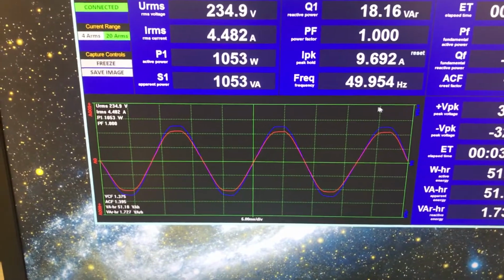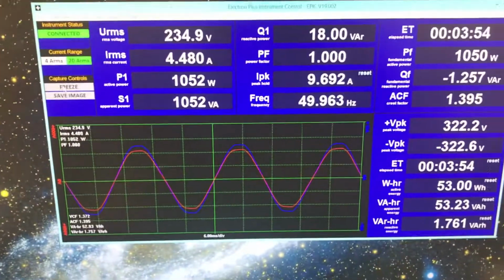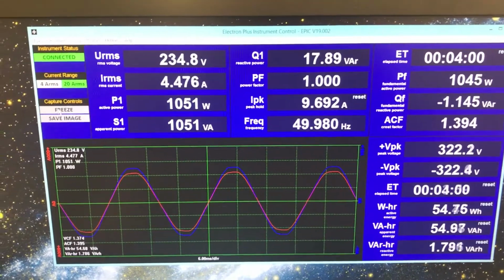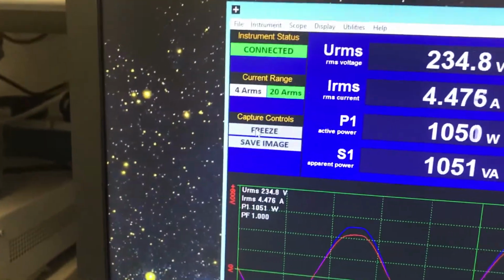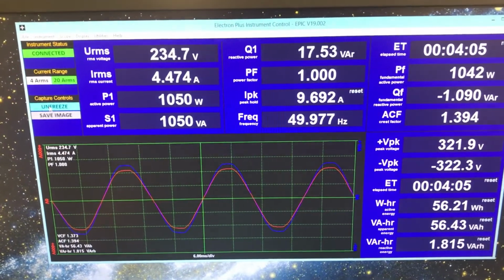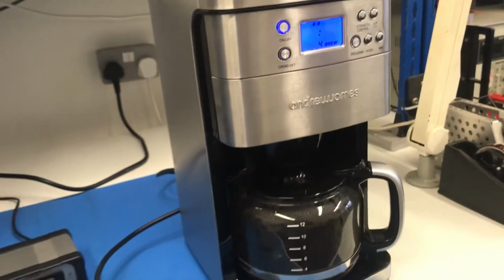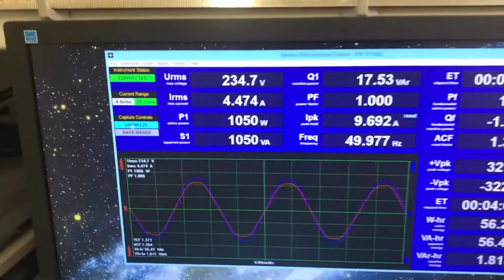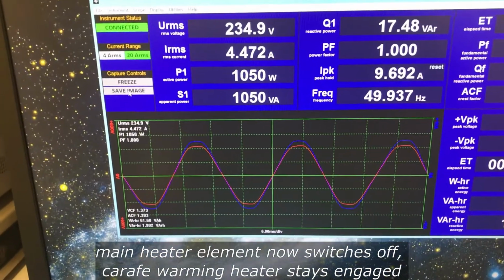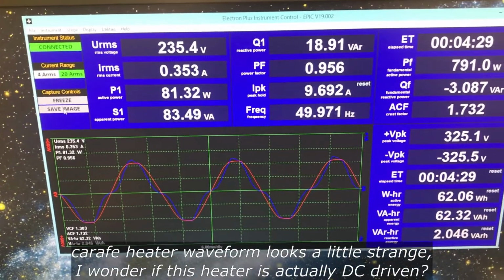And also, one of the problems with a lot of test equipment is that you want to make several handwritten measurements simultaneously, but they're all moving all over the place. This button here just temporarily freezes the screen, and all the data capture is happening in the background whilst it's working. See how the coffee's doing. Okay. There's a save image function which will capture a bitmap of the oscilloscope screen, timestamp it and put it in a directory.